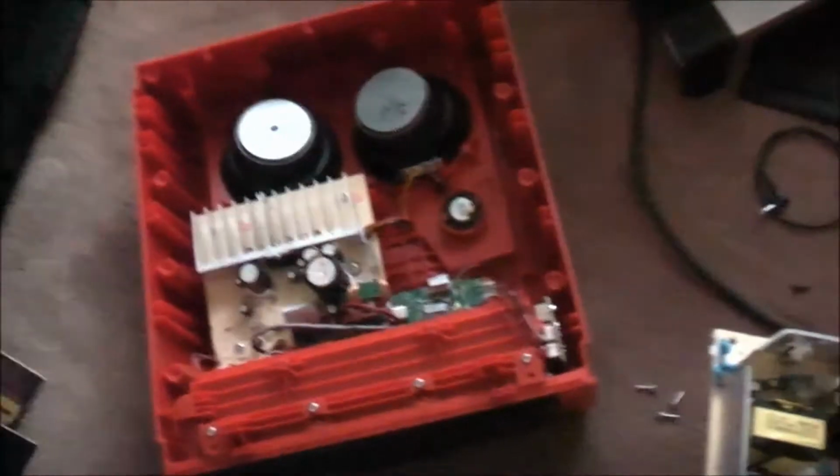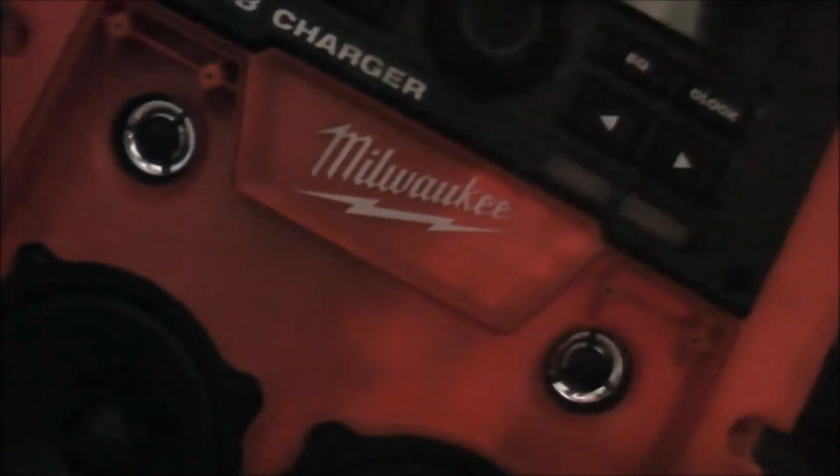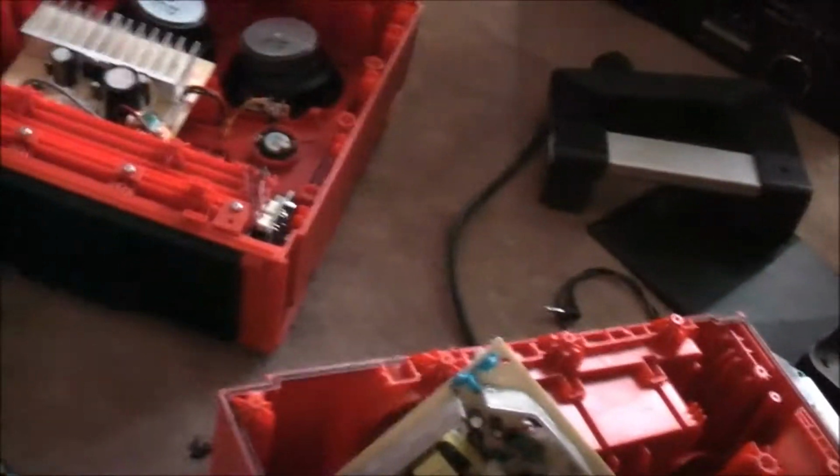I might try and rig up another power supply, put power through and jump it through to the battery charge, just to trick it into thinking it's got a battery in it, because I tried that, and it doesn't charge a battery, but it trips out momentarily, though it doesn't turn off. The display will flash on and off like it's power cycling. You just hear it through the sound. It cuts in and out briefly. It gets kind of annoying, but it's manageable. It still works, but you have to have a charged battery in it while it's plugged in for it to not turn off in standby mode and trip out. It'll run fine off a battery only, but when I plug it in and want to run it normally, especially past halfway on the volume, it just trips out the power supply. It's become unbearably unusable, this radio now.